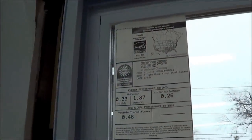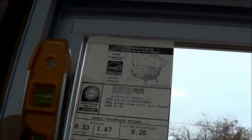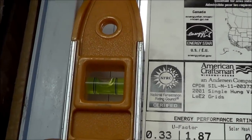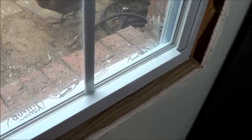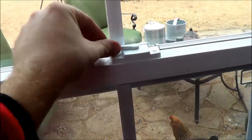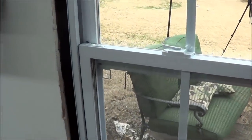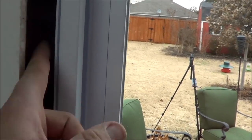We've got our shims in and now we've got to screw it in. Double-check to make sure it's square — put your square up here and as you can see it's perfectly square. Check each corner, make sure your shims are good, and then make sure it opens and closes well. Make sure your screws are flush where you screwed them in, and it operates perfectly. That's all there is to putting in a replacement window. Next is just to work on all the trim work, and I'm also going to put some foam window filler here for insulation around the open areas.